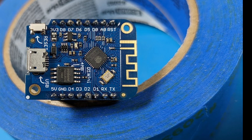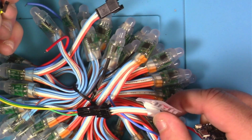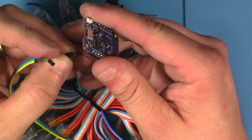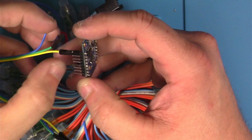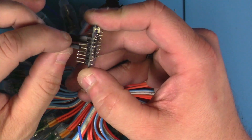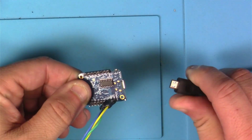Now I want to talk about the connections we're going to make to the controller. We're only focusing on three connections: 5V, ground, and D4. Five volt and ground should be pretty self-explanatory for where you connect those on your LED strip or string. D4 is what connects to your data in or data line. On the bench I'm just using some Dupont jumpers to connect to the LED strip, then using the female side to connect to the headers already soldered on the D1 board. You can solder these for something more permanent, or if you're just playing around on the bench this will be fine.